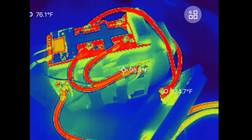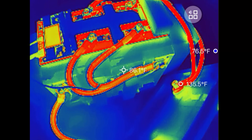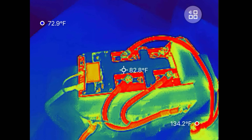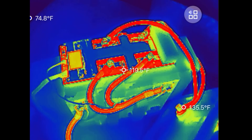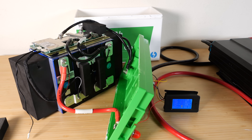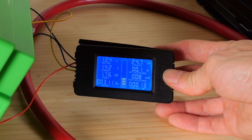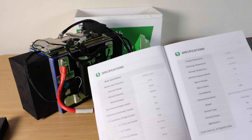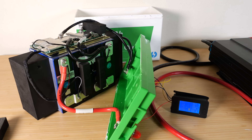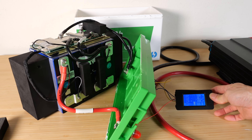I removed the temperature probe and put it back, but that's not going to be the thing that turns it off, because right where the temperature probe is it's actually really cool — 85 degrees Fahrenheit. The things getting warm are the control board at 122 and a terminal at 136. These cables are rated all the way up to 220 degrees Fahrenheit so they're certainly not going to melt. It's not sensing current in order to cut it off — it's waiting for something to get too hot. Having drained 25 amp hours, or a quarter of the capacity, it's supposed to cut off around 65°C, which is around 150 degrees Fahrenheit. The board right now is 130 degrees Fahrenheit, so rather than running it all the way to that temperature, I'm going to cut it short.